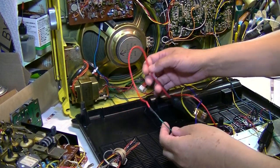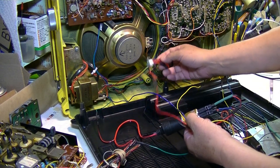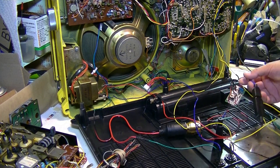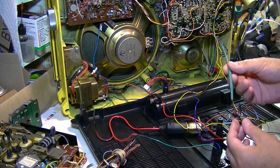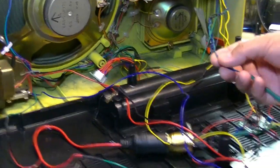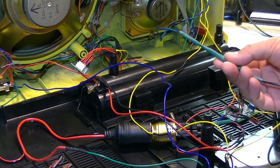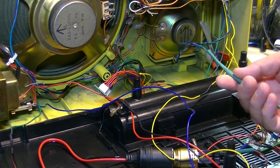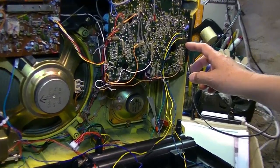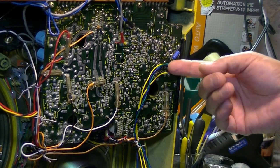The power comes from the power source. This is the same: socket, charger, and two USB. One goes to the LED. This one is where I set up 9 LEDs, and the other one goes to the Bluetooth with the DC isolator. Since this El Diablo is mono, I short left and right inside, and there are two wires for the ground and one music signal line, the mono line. I use a 1 kilo ohm resistor for those two stereo lines to make one line, and this line goes in here. This is a line in. Okay, like this. Here's a ground, and the other one is here, the blue one.